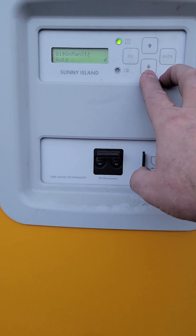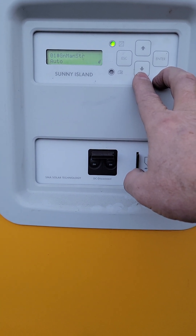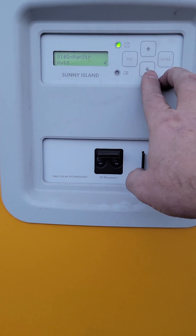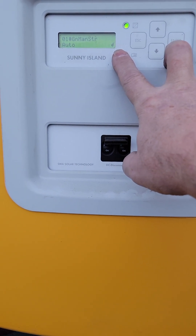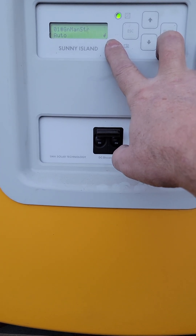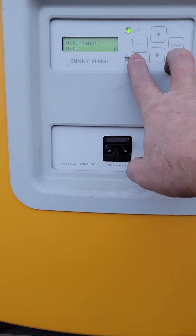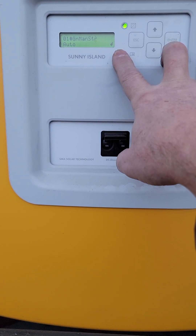The cool-down time is typically five minutes. Initially I was lowering that, but after actually seeing the heat that the generators can get up to, that cool-down time is really good for the generators because it just lets them cool down. And then after five minutes, the generator will shut off. I have had situations where if the inverter is below the critical point — sometimes 50%, sometimes 40%, or even lower in the 20% range — it could be close to doing the emergency start. While the generator is cooling down, the inverter turns right around and says turn it on, and then it will actually engage the generator again, which can be frustrating when you're trying to stop it.